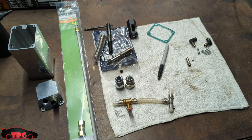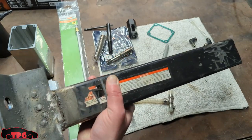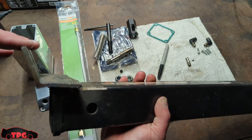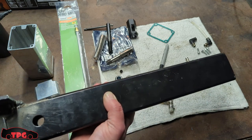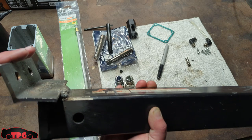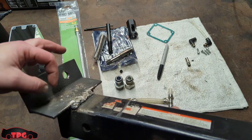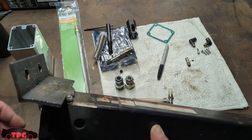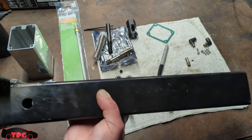Instead of using a tube like the one on the old version — which is just a piece of exhaust pipe — I'm actually going to use this thing over here: my homemade wheel bearing removing tool that I cobbed together. It worked great until it started to bend — you can see it's got a pretty significant bend right here on the angle iron. I'm gonna make version two of this also. This is gonna be our donor piece. I want to make it a little stronger on the next version, because wheel bearings are just a pain. I want a bigger hole diameter, some big fat washers, thicker angle iron, and a better fulcrum point.